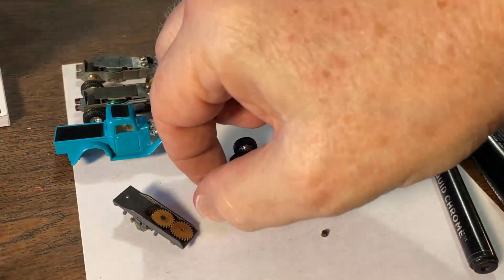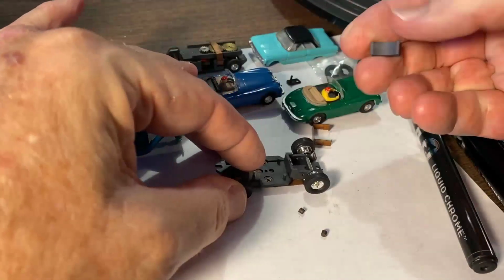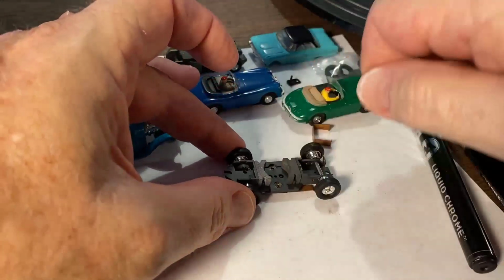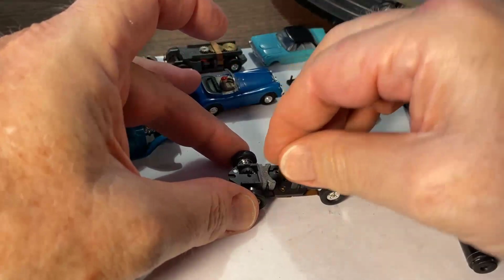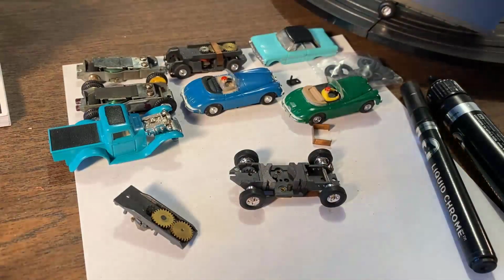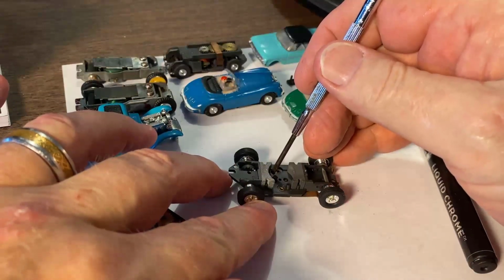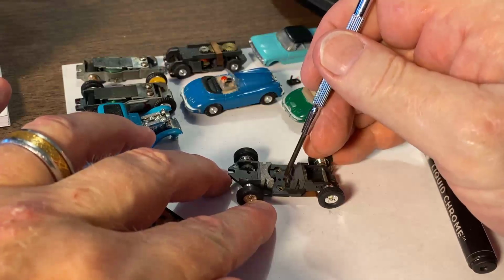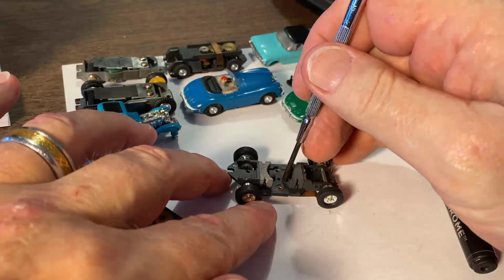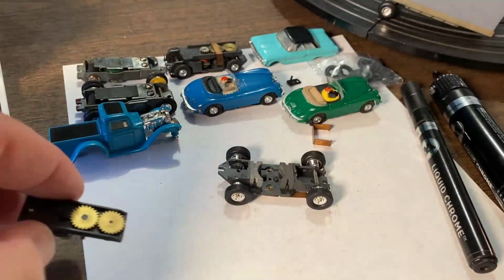Good, let's go ahead and get the magnets back in. I always want to start getting those there. Good. And then the brushes, there's no oil, there's nothing on them. I'm just rolling them around my fingers to see if there's any surface oxidation I can get off, from sitting in there for so long. I mean, when were these things made? 63, 64, 57, 58 years old. So there's probably a little bit of oxidation on there.